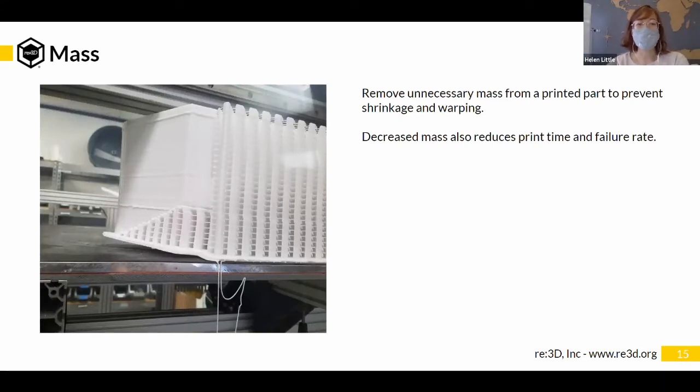When things heat up they expand; when they cool down they contract. How much depends on the material but also on how much material is there. The more material you have, the more it wants to shrink. With a very thin lattice structure, it can shrink within its lattice and it's fine. But when you have a solid block of plastic that's trying to shrink, you get a much larger force pulling on the edges as the whole mass cools down.